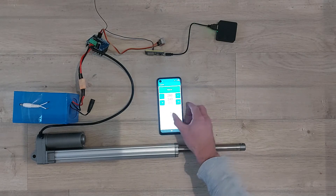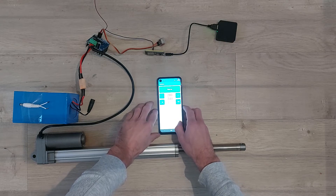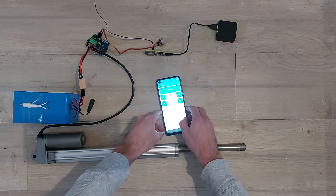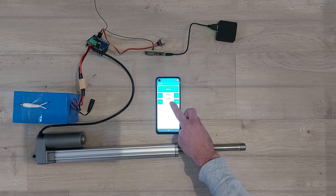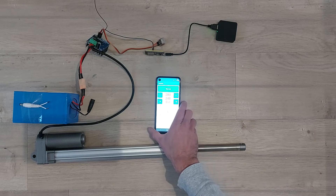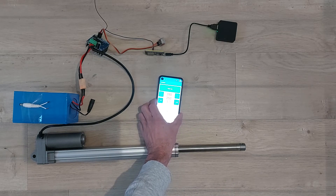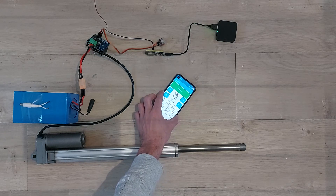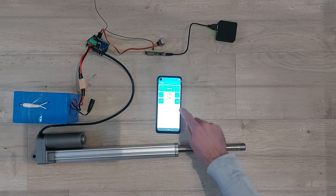This is the app. On top is the previously set course: 280. Below is the compass course, and that is the rate of turn. So if it's 1, it's rotating at 1 degree per second. Pretty hard, but now I'm rotating at 10 degrees per second. Below are some controller values.